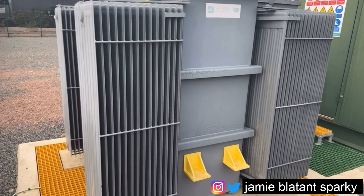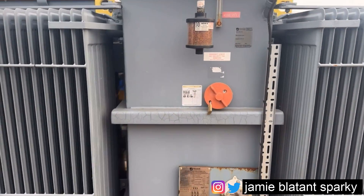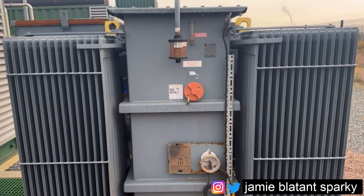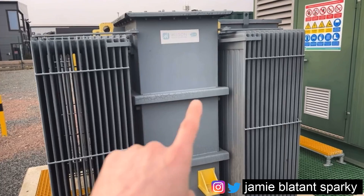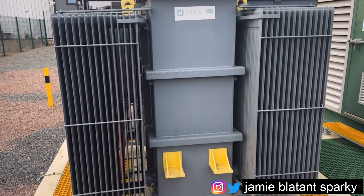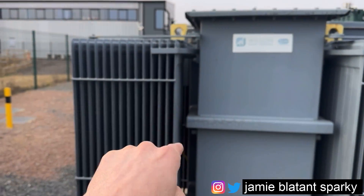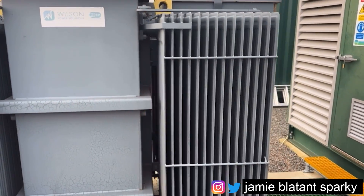Effectively, inside the big grey box there is a load of copper windings that do the transformer bit, and that is all you really need. Everything else attached to it is to enable its operation or safe operation. Inside there, big copper cables come in, cables go out, and it transforms the voltage - hence the name transformer. Within that transformer there is an insulating medium called oil, also used for cooling. The way it cools is it lets convection from the heat of the coil leave the chamber. To assist that cooling you've got these fins or radiators - they're connected via pipes, oil goes through the fins, dissipates the heat and rolls back in. Just like any other radiator.